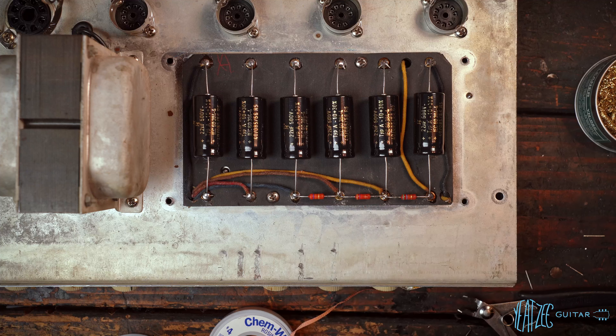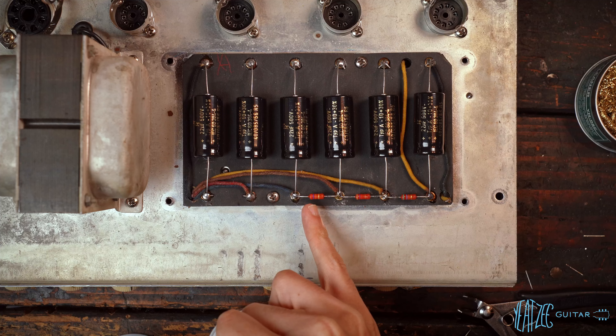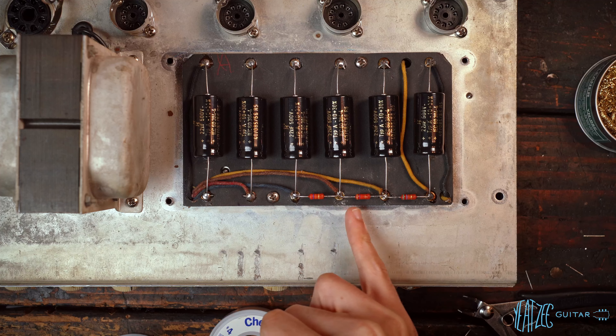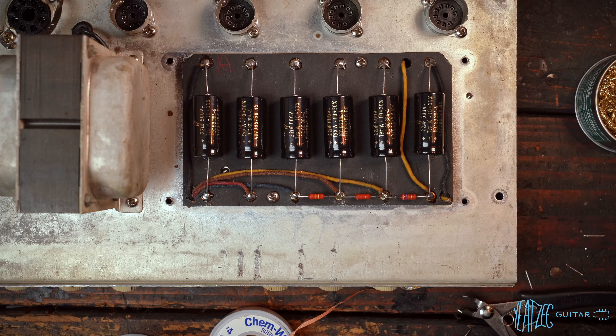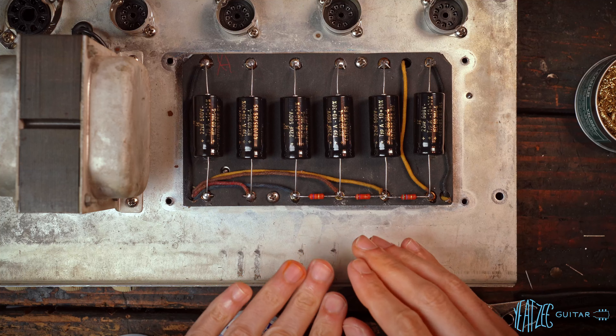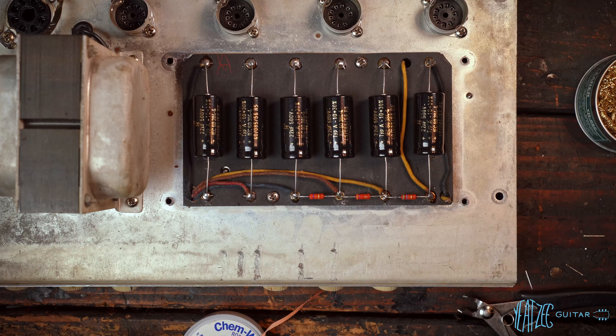I was just being a little OCD about the height of the resistors there, but that's all good. So to recap: we've got the red, violet, orange — so that's 27K. And this is a 4.7K. And then this is a 56K resistor. These are two watts, so they look very small, but they are actually more capable than the much larger original one watt carbon comps.